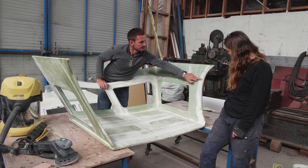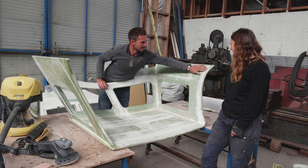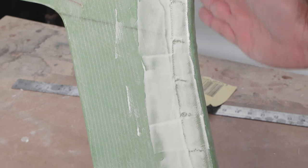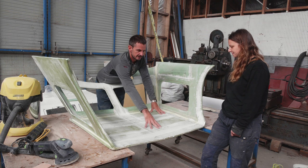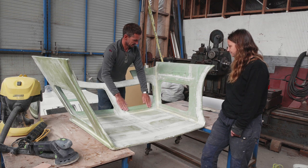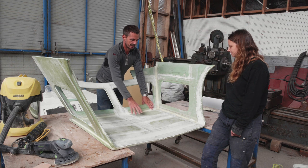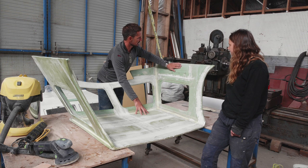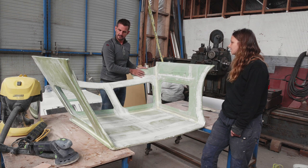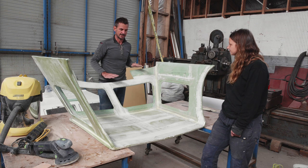I laid another bit of 200 gram tape down here, but because it was curved I had to cut darts into it to open it up. The white stuff is all the fairing compound — as soon as it went tacky I hit it with this. We'll just sand this down, then put a fairly thin layer of the same fairing compound to fill up the fiberglass weave and get it really nice and smooth. Then we'll throw the high build two-part epoxy paint on, sand it again, look for defects, and then we'll glass it onto the boat.